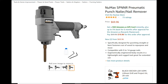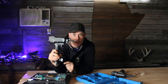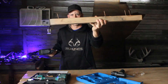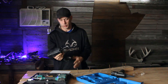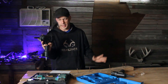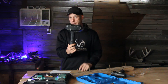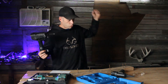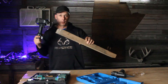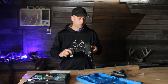Middle of the range — that's where we were for a very long time and I love it. The really good part about this is the metal here. Why? Because you can take a board like this and fold it over so it's straight — that's why the metal on here is important, and it will take it, that's what it's made for. The grip on it is nice, it's well-built. They all work fantastic, but some have a little more power than others. Here, you can easily run this down to 40 psi. It doesn't rifle it through, and you've never been able to fire the big nails through — you have to use 100 psi for those. But for the small ones like in siding, you can bump that down to 40 and this thing works pretty good.